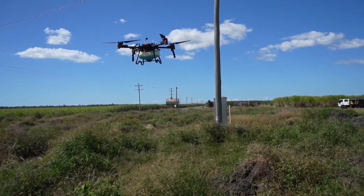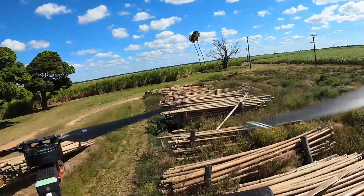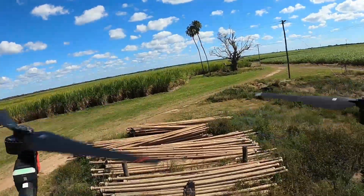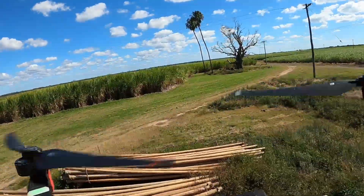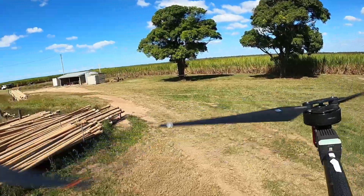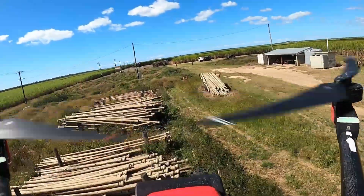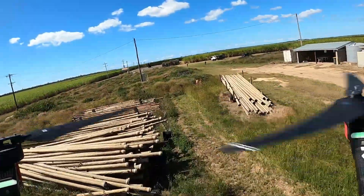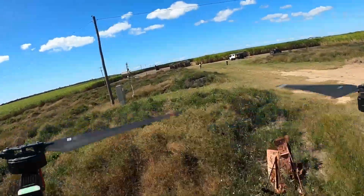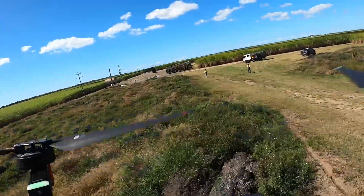It's picked up that same power pole on the second run and gone around it, just to give it enough room. You can change the obstacle avoidance distance — how far you want to keep away from the obstacle. I think we've got this one set on two meters at the moment, but you can change it depending on how nervous you're feeling. We've got some trees up at the other end as well, and it's going around some bits and pieces of farming equipment up there. You can see it's making sure it goes underneath that power line again.